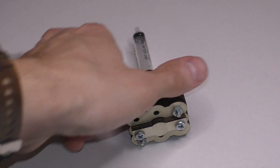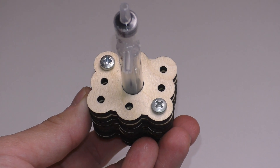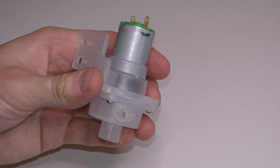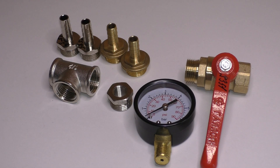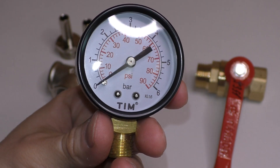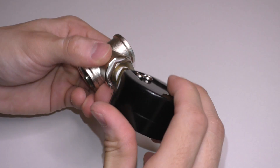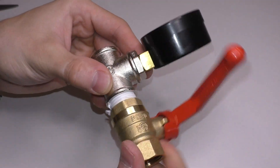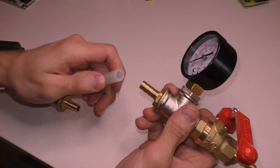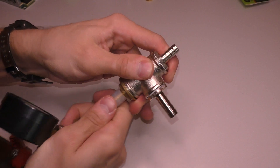After getting the results, we've got a bypass valve fully ready for testing, but we need equipment for testing: pump, gate, pipings, reservoir, gauge, plus a 12-volt source. Assembling the circuit. This gate is needed to close the recirculation circuit, so it will redirect the flow from the recirculation circuit into the bypass valve. The pressure gauge is placed before it to check the pressure in the system.